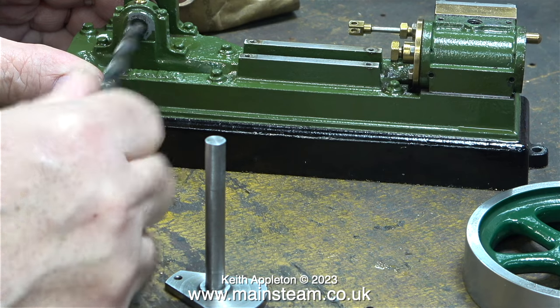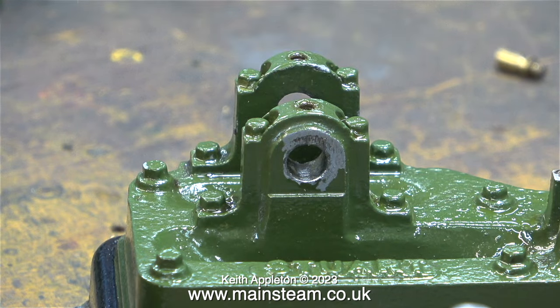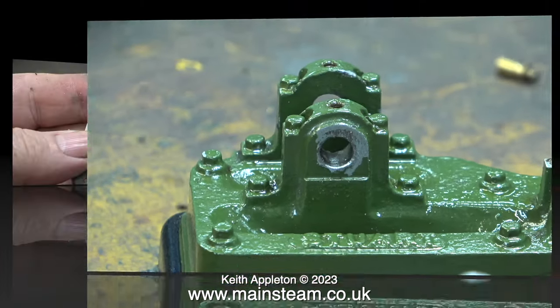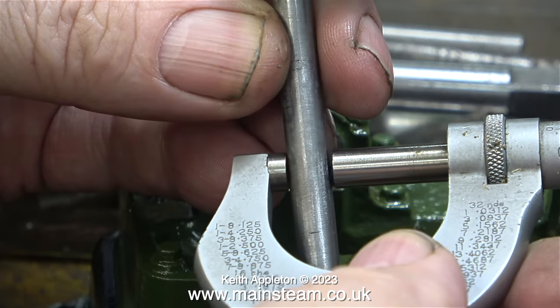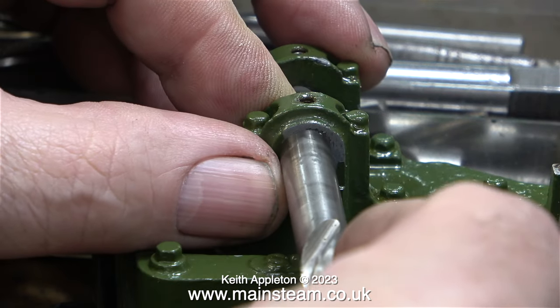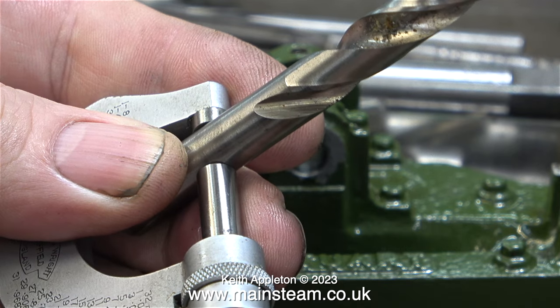Here I'm looking at different drill sizes because I can't decide how big to make the holes to take bushes of a substantial size. The crankshaft is 9/32nds of an inch in diameter, and this twist drill is 5/16ths of an inch — it's too small. I think the main reason these bearings are so badly worn is because of the mass of the flywheel; it's a very heavy flywheel I've never seen fitted to an S50 before. I'm going to make the bush at the flywheel end more substantial. This 3/8ths of an inch twist drill is the one I'm going to end up using.